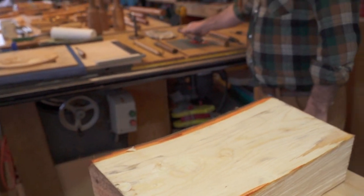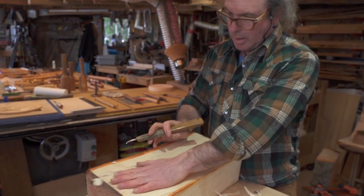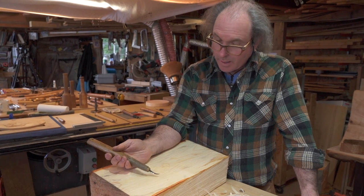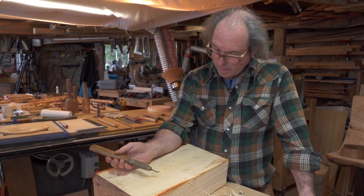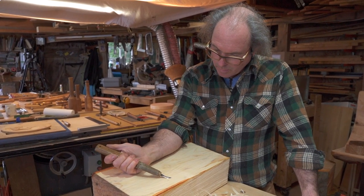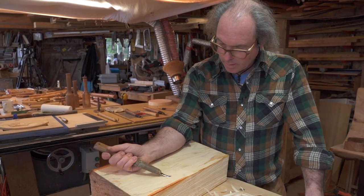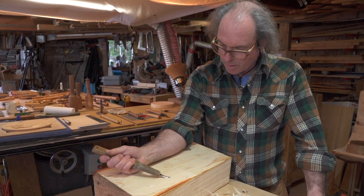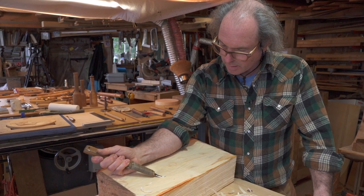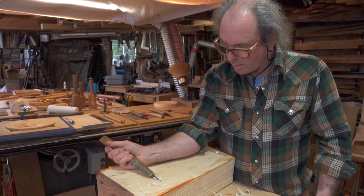Okay. So, you know, I make it easy. I make it look easy. And when you get it, it is easy. So if you're having trouble making a hook knife work for you, you're generally speaking too steep and too square to how you're cutting. So I can't say that enough. Just barely cutting a little tiny bit, and you're cutting on a slice, not square to your work.